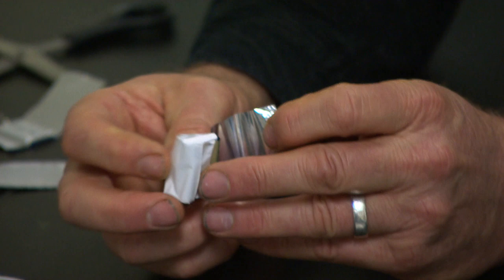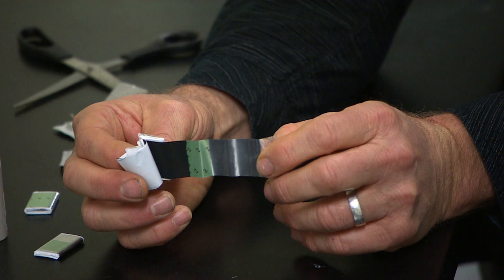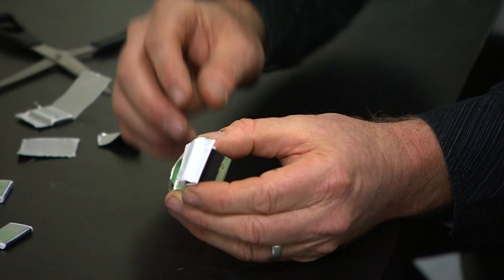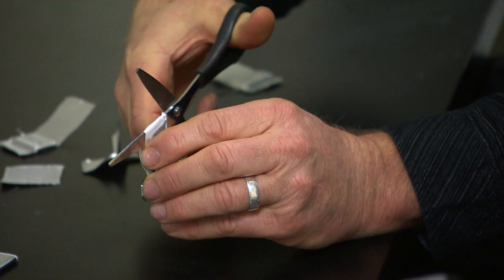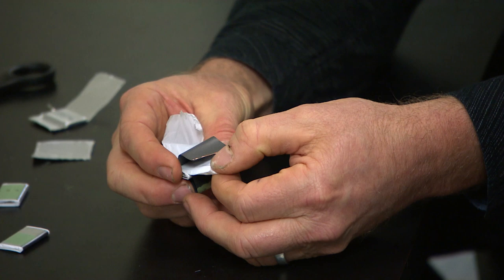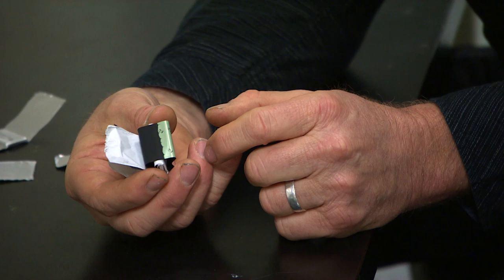The coatings are about 50 micrometers thick, which is about half the thickness of a human hair. Really? Yeah. Then you encounter this white material — this is called the separator. It's used to separate the positive from the negative to prevent short-circuit and also to hold the electrolyte of the cell. The separator is about 50% porous; the pores are about 40 nanometers in diameter. You'd never know by human eye — it's the exact same chemistry as a ziplock bag, polyethylene, except it's been made with holes and it's white instead of clear because of light scattering from the holes.